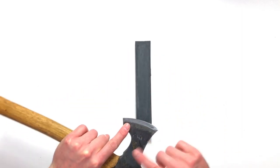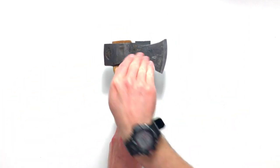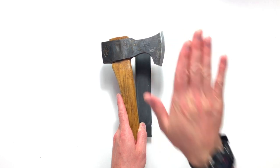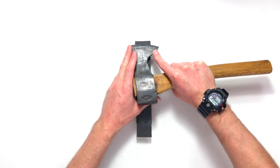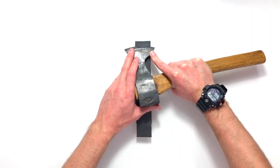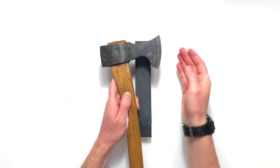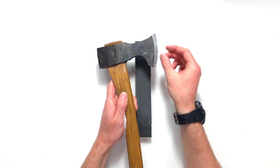I can actually quite clearly see this burr now. What you'd need to do to check for a burr is have the light coming in at 45 degrees — the top bevel with the burr facing upwards — and you should see a glitter along the edge. I'll pull it round to show you: gently raise that cutting edge up until the bevel is flat and then you should see a glint of shiny metal at that cutting edge. I can see it — I doubt you'll be able to see it on camera but that's how you find it.